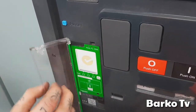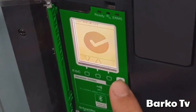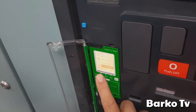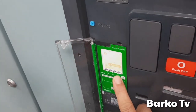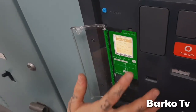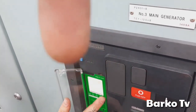They connect it — usually it will be like this. Then you press Home, press down until Protection, and then press OK. Then you have long time, short time, instantaneous, and dual settings. You can go into long time if you want, then change the settings here. When you change settings, you have to press Y for yes to save, and then OK.